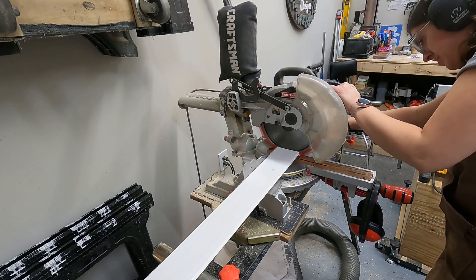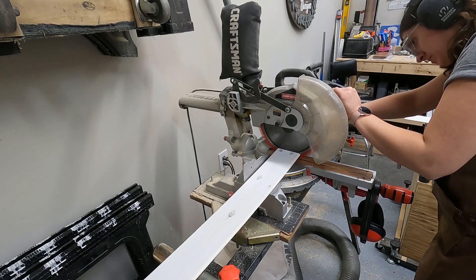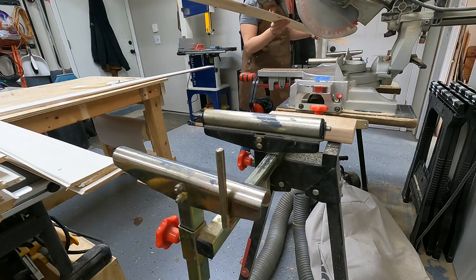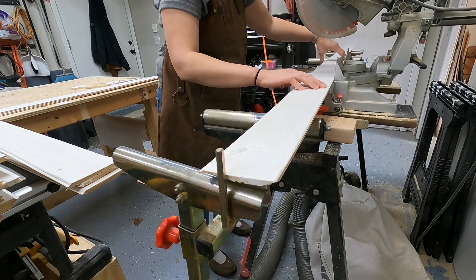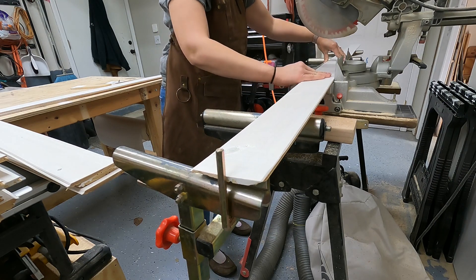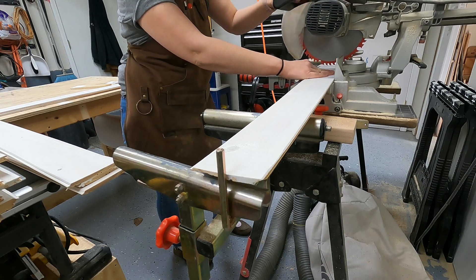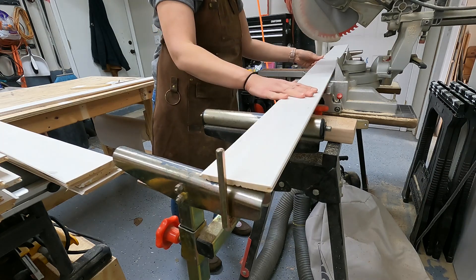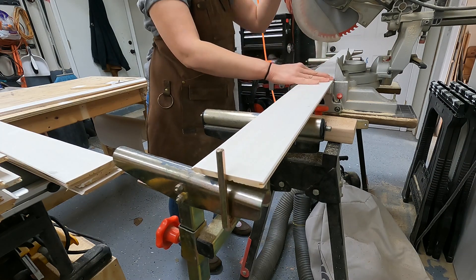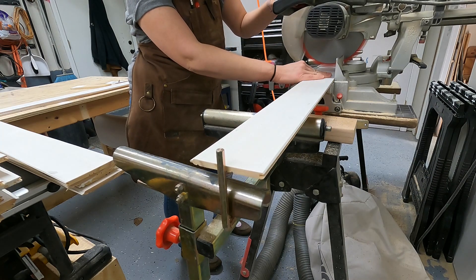I am going to be starting in the corner and working my way to the window. I have a lot of pieces that will need to be cut the same size, so I set up a positive stop to help me get the job done faster. A positive stop is a set point that you measure and set up once — it helps save a lot of time when you're cutting multiple pieces of the same size. Always hold your piece between the stop and the saw. I am right-handed, so cutting with my left hand may feel weird, but it gets easier over time.